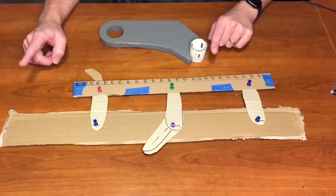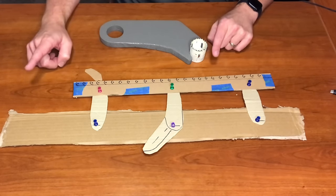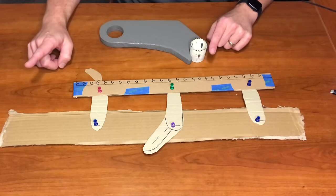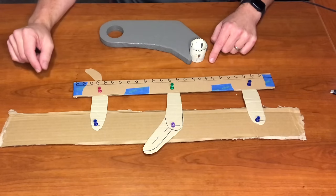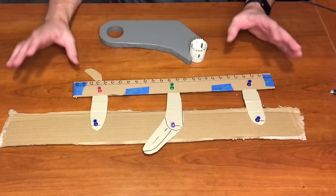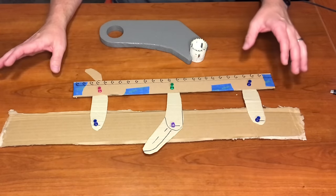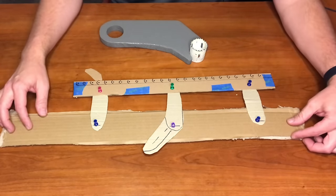The second set right above it is the holy crap, the train is up too high and the chain trough is still not dropped, because it should never make that upper sensor. And in that case, if that train ever hits that top prox, the ride goes into a complete e-stop. It shuts off the hydraulic pump, closes the brakes, everything. The ride's like, major problem. It shuts itself off. But for this purpose, let's see if we can get this to actually work here.